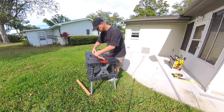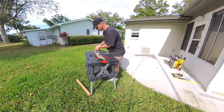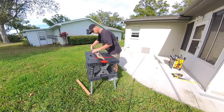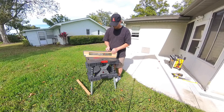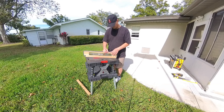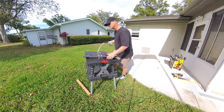With the feed-through unit fitting perfectly, it's time to apply the weather stripping. This was supplied with the MFJ kit, and likely some will be supplied with yours. If you're not happy with this weather stripping because it's not a perfect fit for your application, you may have to go to the local home improvement store and find something that's a better fit for your particular window. Our weather stripping is on, it's back in the window — we're ready to hook up coax and start operating, right?